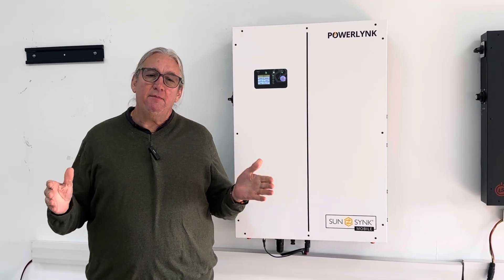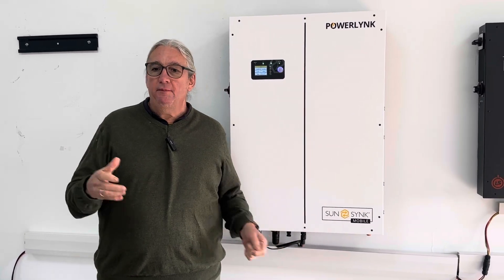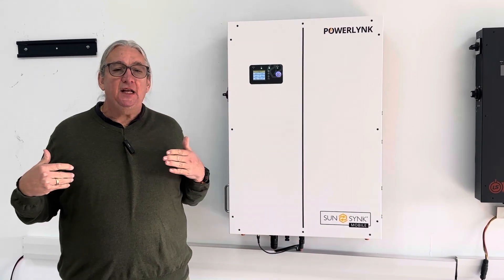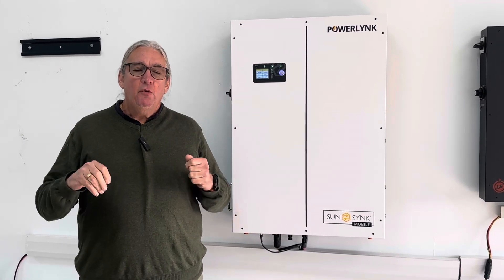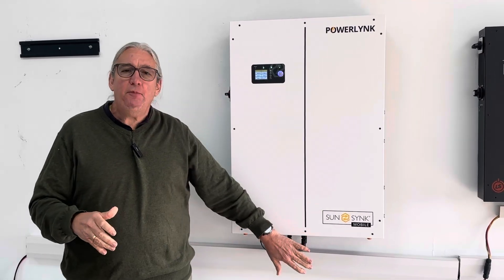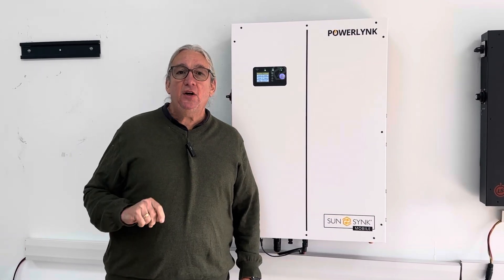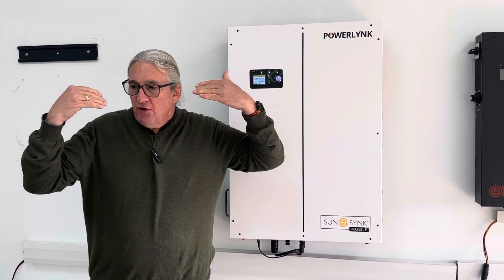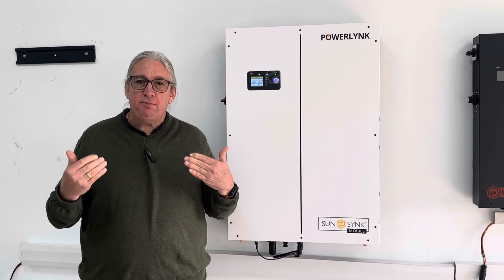I think this could be amazing. If you just want extra battery, it's got full comms. You can use separate additional batteries. If you use two units together, they will communicate. If you've got different sizes, they can work together. You just plug into it — connect, plug in. The CT coil is wireless; it comes as standard with a wireless CT coil. And if you're in colder environments, it's got battery heaters so it can heat its batteries.